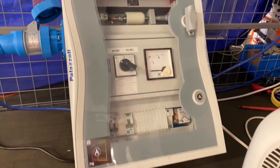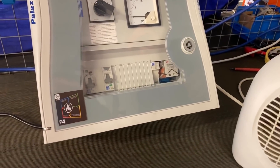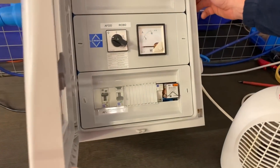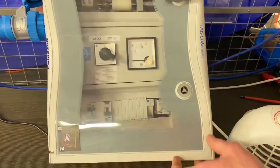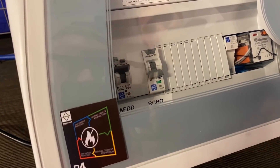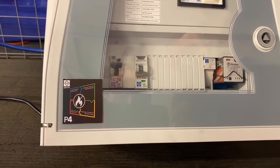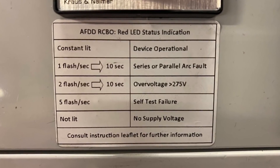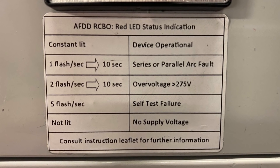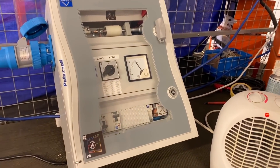There we go — it's gone off. I can tell because I'm not getting as warm as I was before; the heat has gone off and the AFDD has tripped. Now they're really clever, because when you reset them it actually tells you what type of fault you've got. We reset the device, close the gap back up on the copper rod, and clear the fault. We're now seeing a flashing light on the AFDD — flashing once per second for 10 seconds if the fault's no longer there, and then it goes back to the healthy position. This label provided with the AFDD RCBO will tell us those flashing light sequences and what they mean.